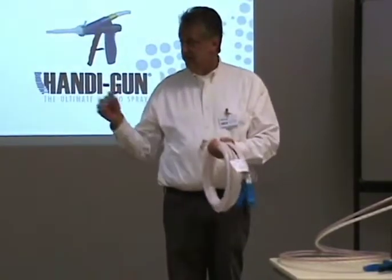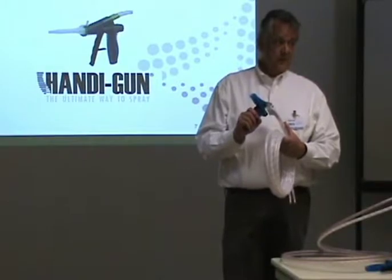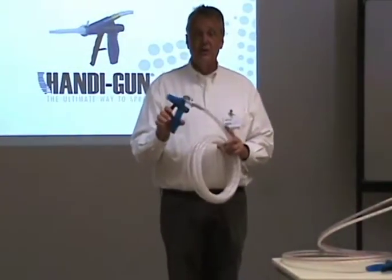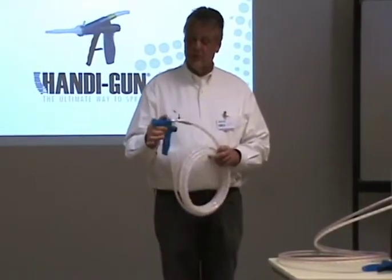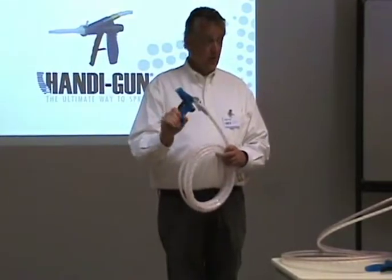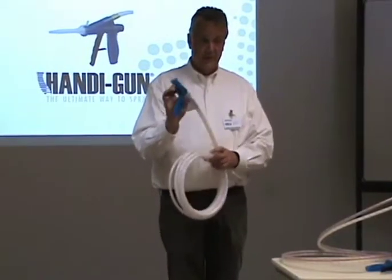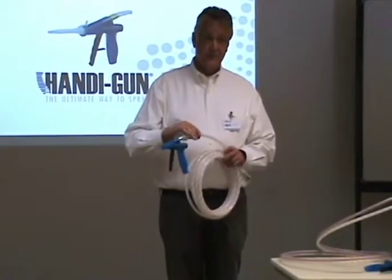I think one of the things you need to emphasize, Dave, I forgot to mention this. The competition that you'll come up against with this gun is full trigger pull. So there's Convenience, Dow, and RHH, which are the other three products. With their gun, they're pulling full trigger. So when you convert the Dow or Convenience guys, this is important for you too, they have to be told half to three quarter trigger. Because if they go out and spray this the first time and pull full trigger, it's going to be twice the volume coming out as the kits that they're used to.